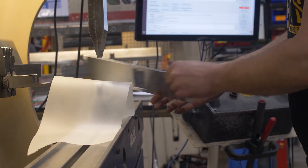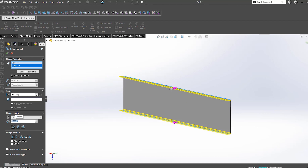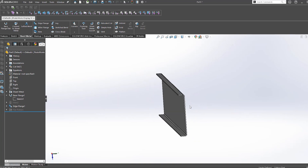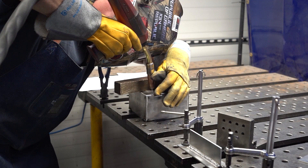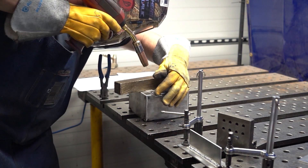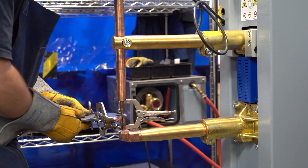We've got a link below in the description about hem bends specifically. Another bending option is to put an angle bend on that edge — it doesn't necessarily have to be bent 180 degrees on top of itself like a hem bend. Simply bending that edge will help prevent that perpendicular force from twisting it out of shape. Another option we typically recommend is introducing welding into the design. If your material is too thick to do a proper hem bend, you can always cut a thin strip of material and spot weld it to the edge of the part, which will act in the same manner as a standard hem bend.